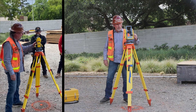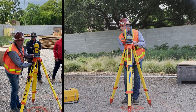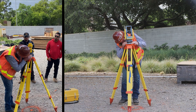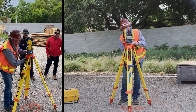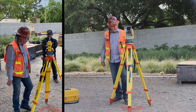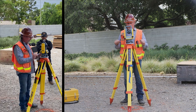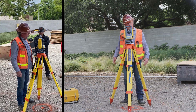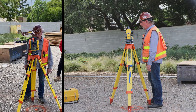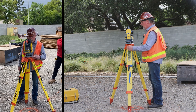But I need to make sure I'm on my target, so I'm going to flip back around and check my optical plummet. It's off by just a little bit, so we can unscrew this and slide it on its base plate until we're over our survey point. Now we need to check all of our leveling bubbles again and go through that same process because we moved it. Base plate looks great. I'm going to switch over, put it over the two leveling screws — looks good. Then go to the last one, turn it 90 degrees, wait for it to stop traveling — we're level.